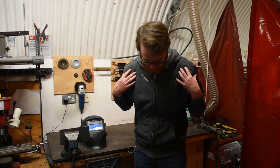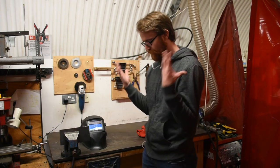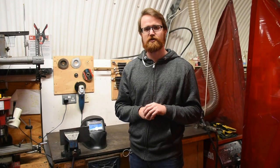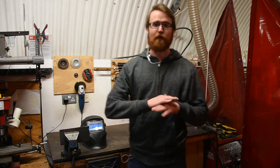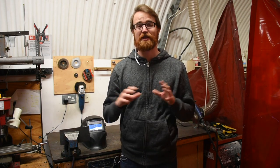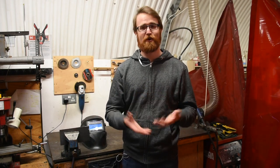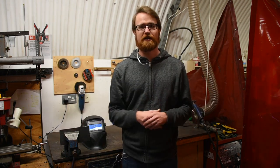The first thing we do is wear protective clothing. You can see I'm wearing sleeves; I'll be wearing gloves over my hands, the mask will cover my face, and I'm not using a thin material like thin cotton that the UV can just penetrate through. So both my eyes and my body will be protected. Around the area, I've set up the welding curtain to make sure that everyone within it is protected similarly, wearing the mask at all times while welding is occurring, and those outside are protected from UV.